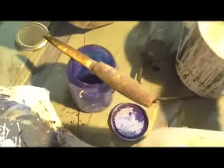Now this paint that I've got here is homemade, but it's in a pot that came from a Swedish manufacturer of linseed oil paint. It's very good paint. I liked it, but I ran out before the job was finished, so I just used the same pot and mixed more. This is titanium and zinc white, a 20-80% split. The zinc is good for exterior paint because it's slightly antiseptic. Helps to stop funguses growing on the outside of houses.